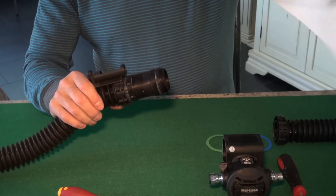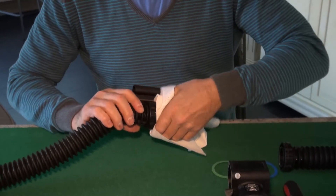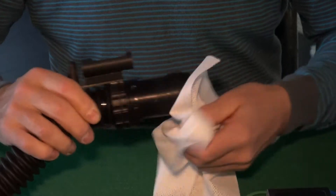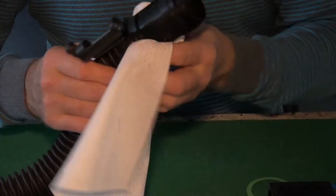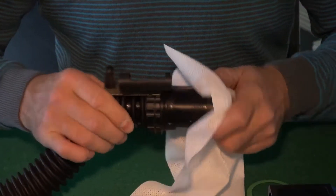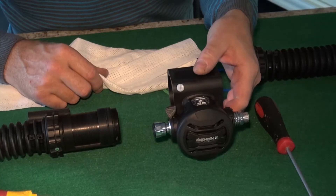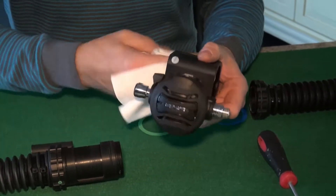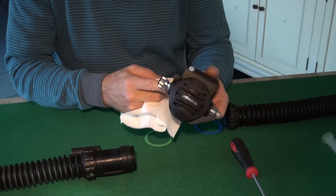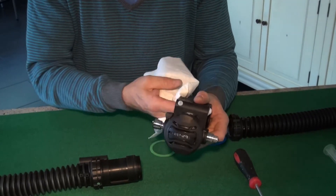For this service, we're just going to clean with a clean cloth, taking off all the old grease and any grit or sand particles that have entered the unit. There's no need to use detergents at this stage — that would be for a full service. Now clean the inner part of the outer barrel, removing all grease and grit. You can also do a small inner barrel check for deep scratches; minor scratches won't affect the performance of the DSV.